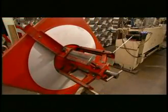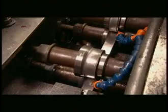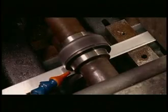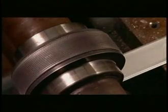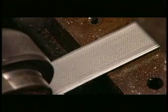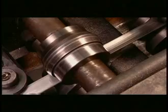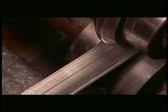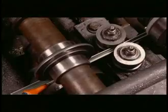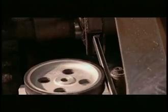Meanwhile, a roll forming machine uses a series of pressured rollers to gradually shape an aluminum strip into a hoop. The first roller imprints a knurl into the aluminum, tiny dimples that improve the bond between the aluminum and the epoxy. The next series of rollers fold the outer edge of the aluminum strip inward, creating Evans' unique rollover hoop profile, which prevents the film and epoxy from pulling out when the head is under tension on a drum.